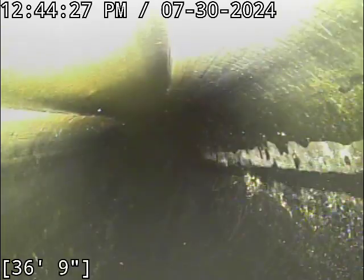But it makes your tolerances much tighter. In this first 40 feet here, you've got to run things a lot tighter rather than putting a nice, harder angle on it that's much less likely to belly. So the belly here dissipates off at about 37 feet. You can see the water starting to flow off there.